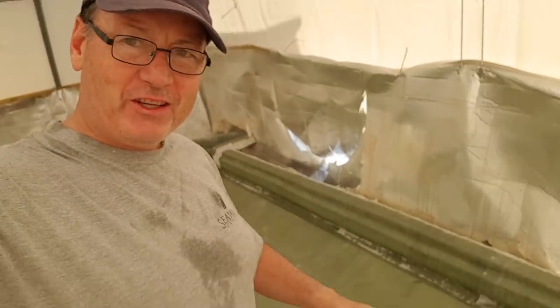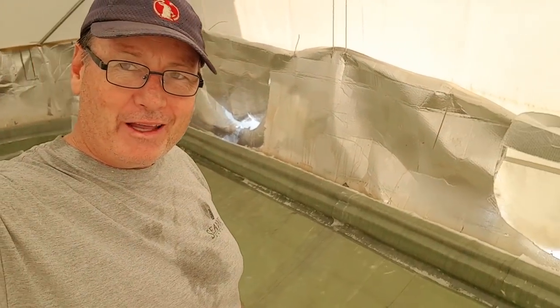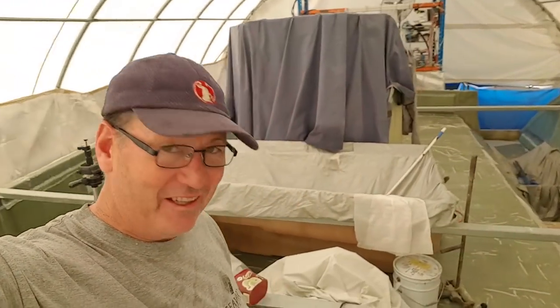So it appears I've been cheating you guys of that section that I just did along that four beam there, which is 1/300, 1/1200, 1/300, 1/600, 1/300, and peel ply, is around 8 hours of work. So by time lapsing it, I'm not showing you exactly the time frame that it takes. To laminate this entire hull, as you see it here, I've estimated around about 5 months of solid work, probably 8-9 hours a day. So don't ever underestimate your time when you're building something like this.